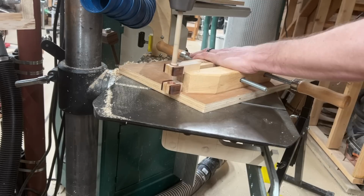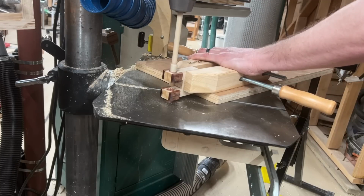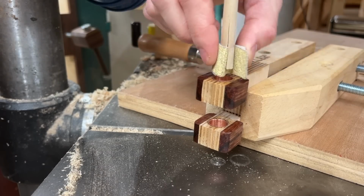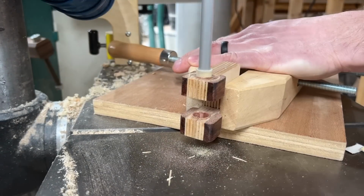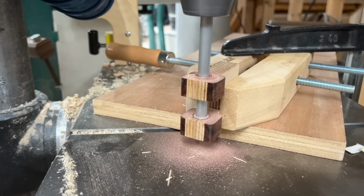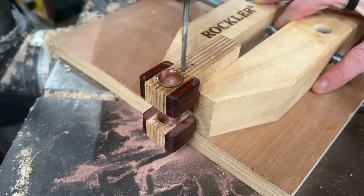I was being really careful with the fit of these two bushings I made out of pipe, because if they get too loose around the threaded rod, then the flip stop is going to wobble and not stay in place when you bump a workpiece into it. But what I should have done is started with a longer length of pipe, glued it into both sides, and then just cut the middle out. I kind of did this the long way, but took my time doing this sanding operation, snuck up on it, and ended up with a good tight fit.